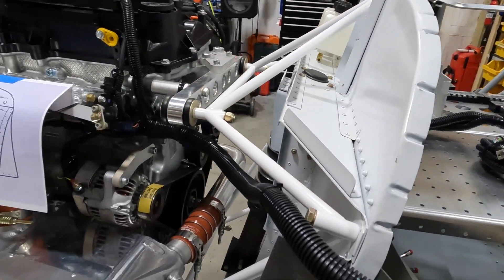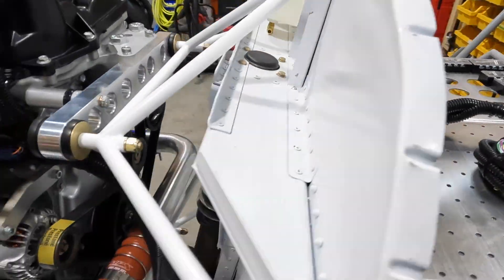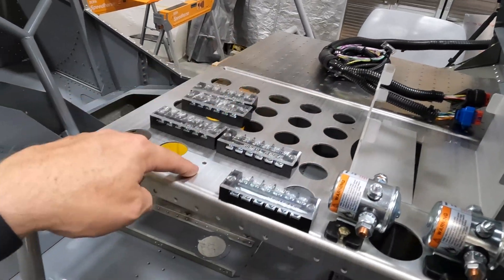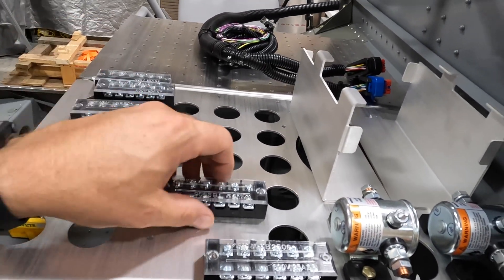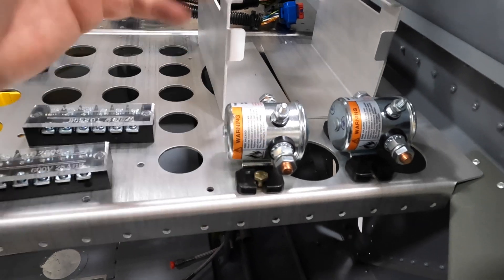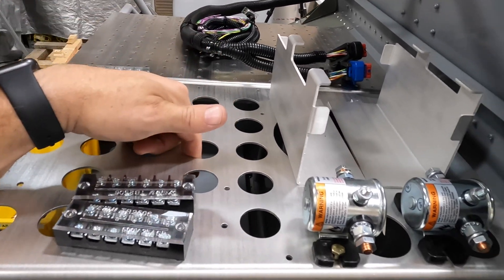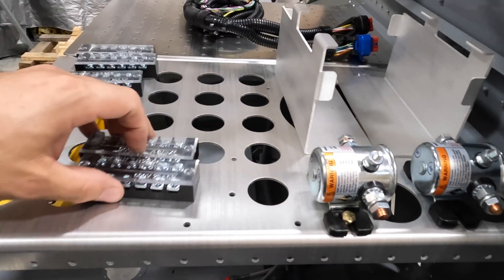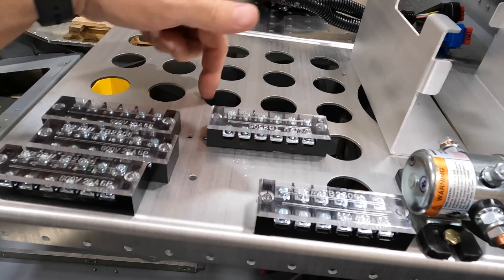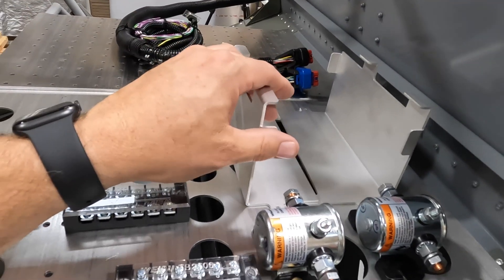In the last video I had my avionics trays flipped around — thanks to Alyssa for clarifying. This tray with all the holes in it is actually the battery tray, pre-drilled for terminal blocks, solenoids, and such. You just drop in some hardware and you're pretty much ready to start wiring. You can see the two holes are pre-drilled, so all your positive/negative terminal strips go here, and you can add grommets or plastic bushings for the pass-through holes.